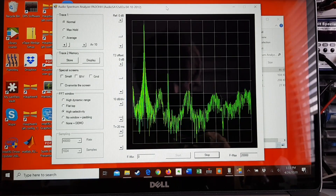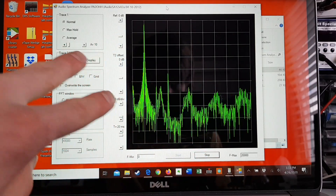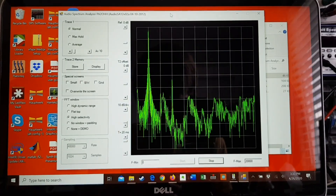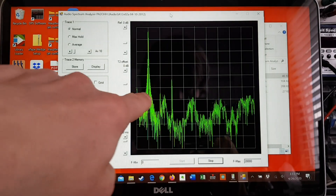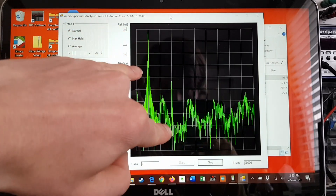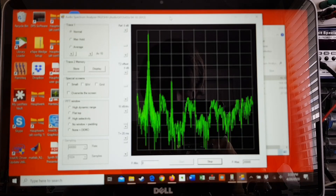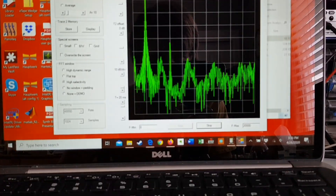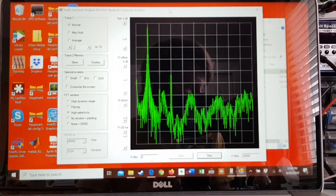There's quite a bit of noise visible, but this is just the function generator at the same frequency and similar output level running through the attenuator — so there's some second and third harmonic distortion sitting at about that level, around 40 decibels down. So really, this amplifier isn't adding any serious distortion, as you can see.